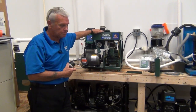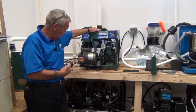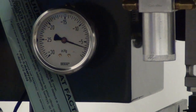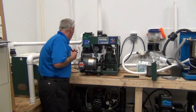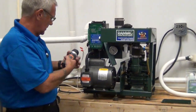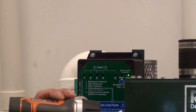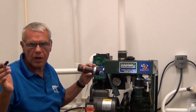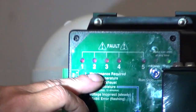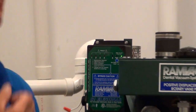Pump's running good. Give it a little time to heat up. We're going to power the pump back down. On the side of the pump — the S1 electronics — we have a reset button hole located about an inch down from the top of the control box. With the machine turned off, take something non-conductive — an ink pen, a Q-tip with the cotton broke off, a toothpick — stick it through the hole. You will contact a button and that resets the machine, turns the maintenance required light off, and also turns the flashing light off on the control panel. Your maintenance is completed at that point.